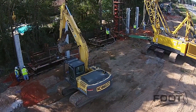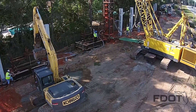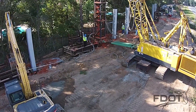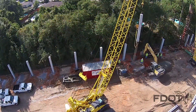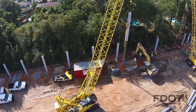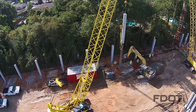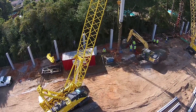For scheduling purposes, drilling to the needed depth typically requires 5 to 10 minutes depending on the depth and the soil conditions. The grouting work requires an additional 5 to 10 minutes. Depending on the experience of the crew and the template type used, the installation of the post requires up to 20 minutes. All told, it is typical for a contractor to install 5 to 20 auger cast piles and posts in a single workday.